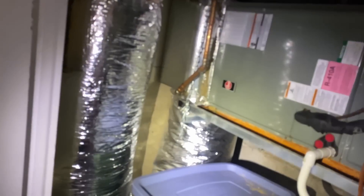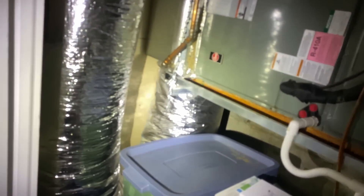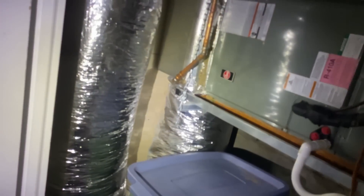Here is the air handler. This coil with these two pipes is blazing hot, so somehow that coil is getting heat. Your air conditioning is running and the heat is running at the same time, and the house is probably not cooling off. We need to find out why that's running. Process of elimination — we're going to go to the thermostat and take it off the wall and see if the problem stops.